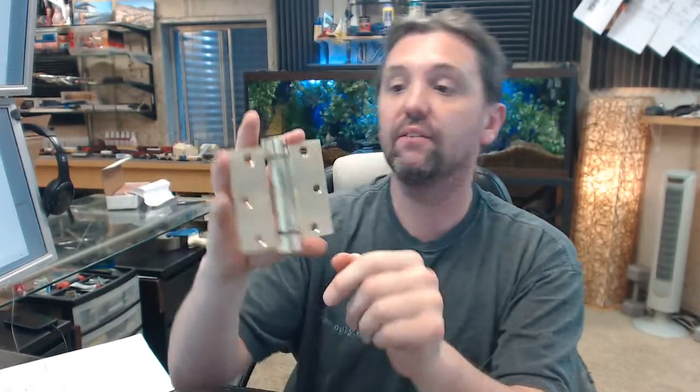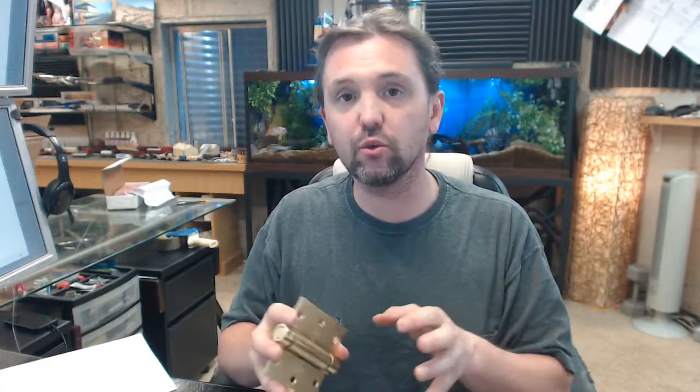Another application that you'll have is a hinge like this will be installed on the exterior entry door of a 3-flat building. Well, in the wintertime, all the windows and doors are closed up, and you can set the tension on the springs to get it to reliably close. Well, in the summertime, you might have the back door open or some windows open, and that air will just come through and race through. So you're going to back the tension off a little bit. When you've got more spring hinges on reserve, you've got more options in terms of getting the door to operate properly so that it closes without slamming. Because keep in mind that spring hinge has got to overcome all that air resistance, overcome the weight of the door from basically a dead stop, overcome the resistance of the latch bolt hitting the strike plate as well.